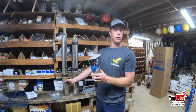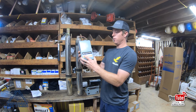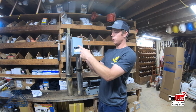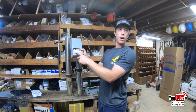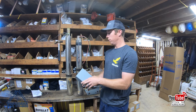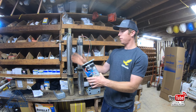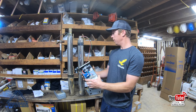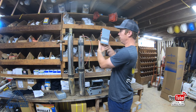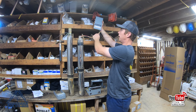If you had a one-horsepower pump that was a three-wire motor, you have to have this control box mounted above the well. Your pump wires come into the control box and then your power wires come out of it. That's the only difference — these components for a two-wire motor are located down inside the motor, whereas for a three-wire motor they're mounted up here above ground, with the wires just going in like this.